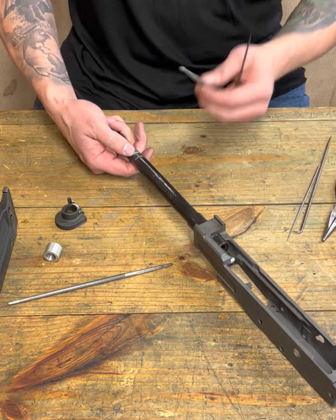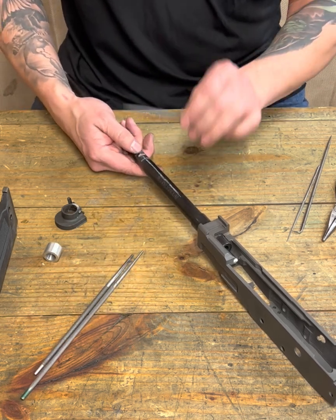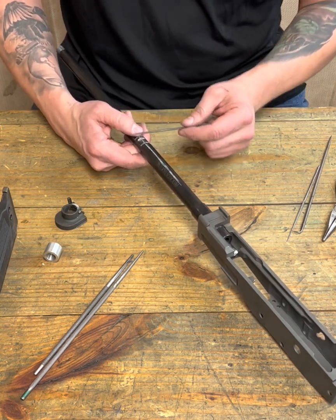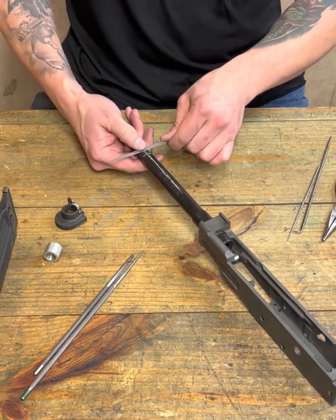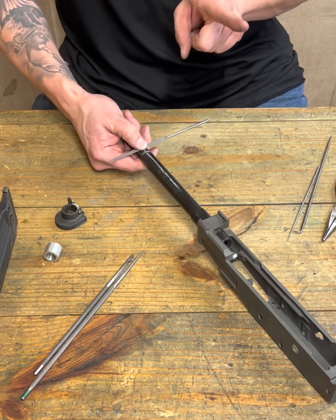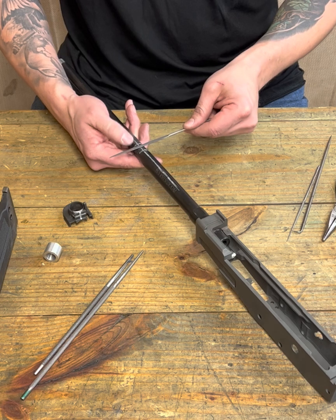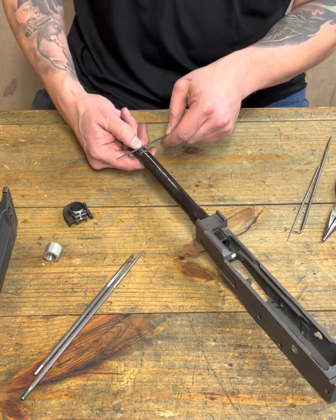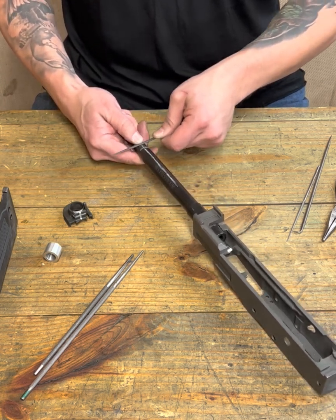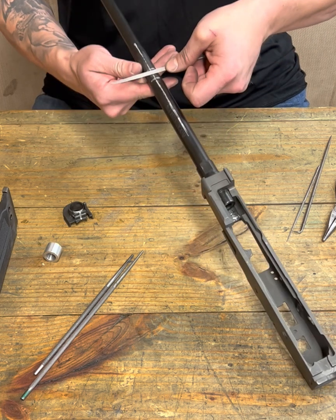Like I've got it cut, and we moved material with our rat tails, but now I can get in here, and this is where we can really make minor adjustments, but it's the little things, it's the details, right? So, if you stick it down flat in the trough, we're just digging deeper down in the same direction. If we need to tighten it up and we need to go that way with our handguard retainer, well, cool, take your half round and just angle it, and I can use my thumb to brace this, but now we're using the half round to open up on the back end, okay? Instead of removing material uniformly across there,